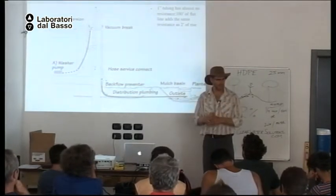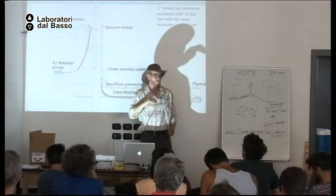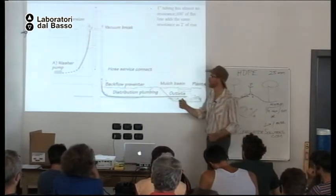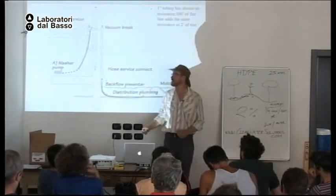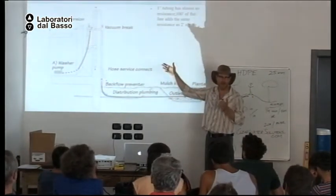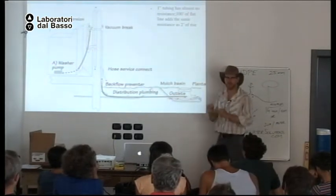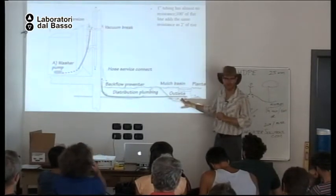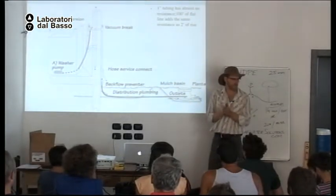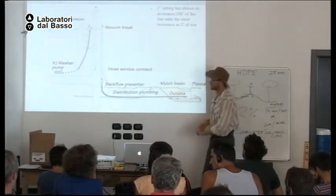So there are some limitations with this system. First, you don't want to pump the water higher than 1 meter above the washing machine. Maybe you can do more, but you risk burning out the pump. Second, you don't want more than 35 meters of length of 25 millimeter irrigation tubing, because if you have more than that, there's too much surface friction, you're pumping the water too far, and you might burn out the pump.